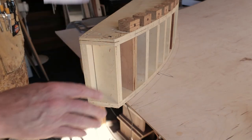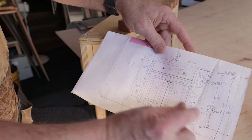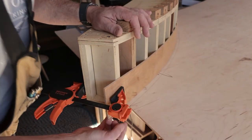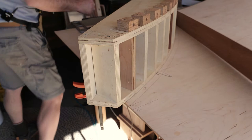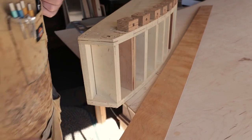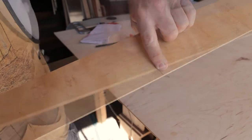The other thing I needed to figure out was the measurement from one end to the other of the radius, so I can figure out how wide all these parts are going to be. I'm going to make all the parts long and a little wide so I can cut them down. What I like to do is take a hunk of quarter inch material, clamp it down, mark it, then cut it and measure it that way. I mark it at the face, then release it and measure from mark to mark. I'll just cut it on the chop saw and I'll know my length.